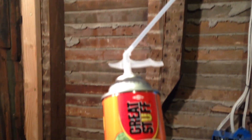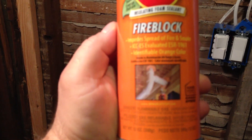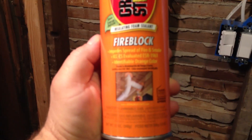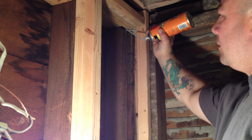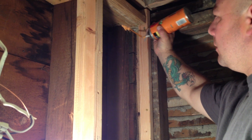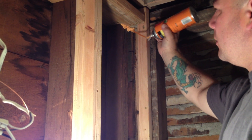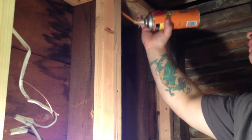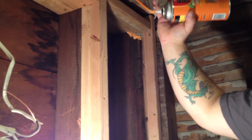It's also called thermofiber. What we're going to use on a lot of this stuff is the spray foam fire blocking, which you basically spray into the spaces that you cannot get to from cutting. As you can see here I'm spraying it into a lot of the fine spaces and it's going to expand.